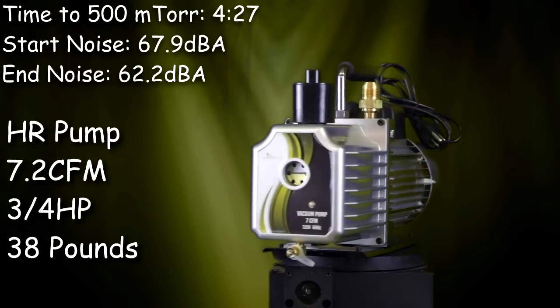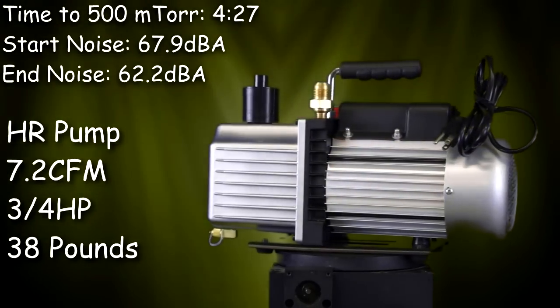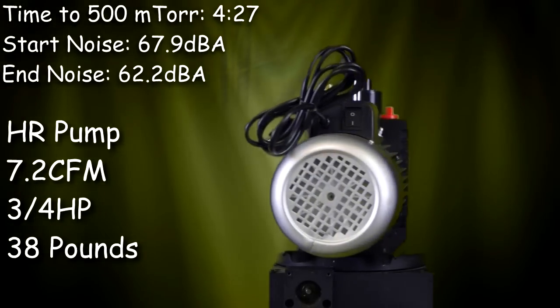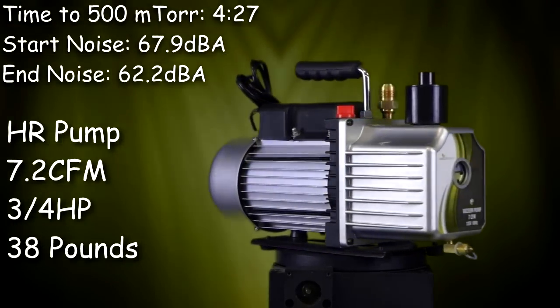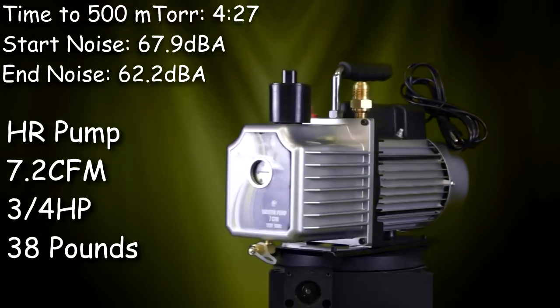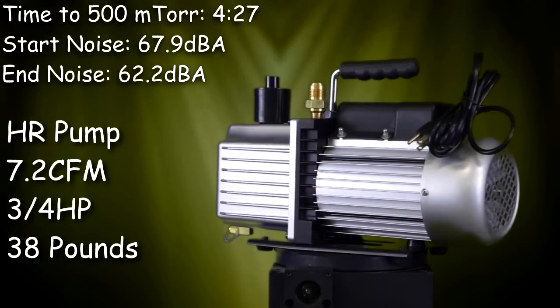Now let's take a look at the new Harvest Right branded pump. This is actually a 7.2 CFM pump. It's a 3/4 horsepower. Now it turns out when they built the Harvest Right, they set it up so that it could handle a larger pump. And so existing Harvest Right owners will be able to plug the new pump directly into their Harvest Right, and it'll be able to handle the 3/4 horsepower load.